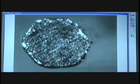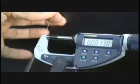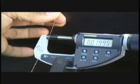To ensure the highest level of quality, the high-carbon steel core wires are first checked visually under a zoom stereo microscope to verify their hex shape and consistency. We then measure the core wire's diameter with a digital micrometer to test its adherence to our prescribed specifications.